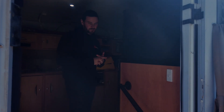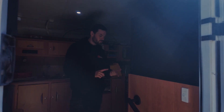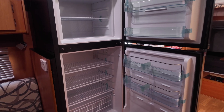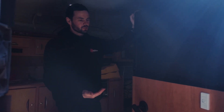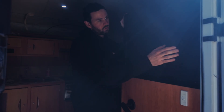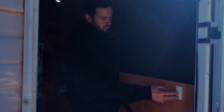Just jumping into the entrance here — we chucked this little handle on just to make it a bit easier to get in and out of the van. We made it black to suit the rest of the upgrades. We've also chucked in a 190-litre Bushman fridge. It originally had a small 130-litre three-way fridge running off gas, 240V, and batteries, but we removed that because they're pretty inefficient. To fit the 190-litre, we had to cut the bench top off, make up infill bracket panels, painted them black, and put it on a switch so they can turn the fridge on and off.